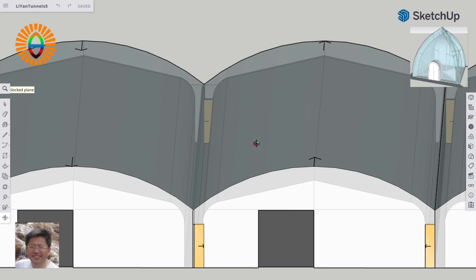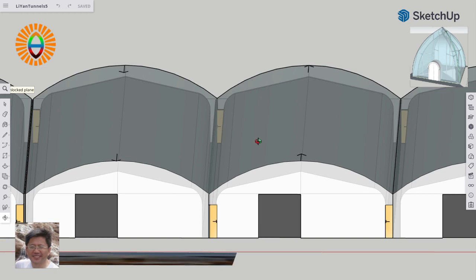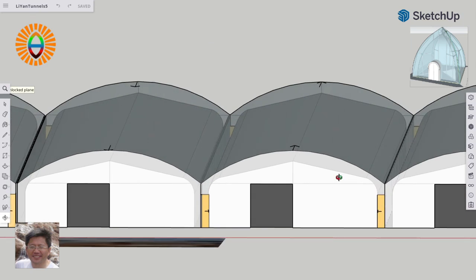So the operation is this: we turn on the fan to blow air. If the internal air is not enough, because it has to be slightly pressurized, then we can borrow some external air and then create a slightly pressurized internal space, so that the exterior cover expands and separates from the internal layer. Okay, and once it's fully separated, we can turn on the spray nozzle, create the spray, and then the fan will simply blow through the screen and create bubbles. That's how it is.